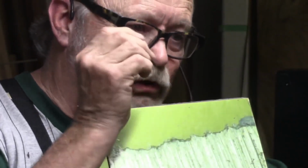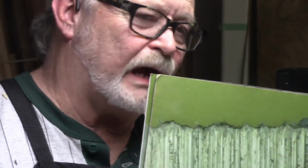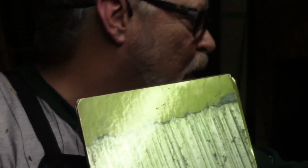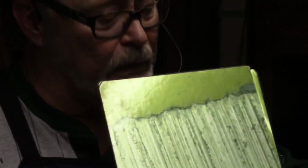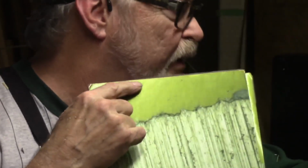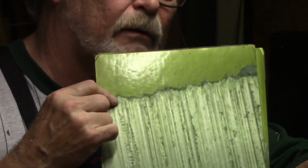And the grains are so perfect, and it's such refinement. And so they had heard stories too, and I've had professionals tell me that some of the tools like Jerry Glaser developed, you can't get them sharp. You can't get them as sharp. So they had me do a whole series of studies with gouges and skews, and then later with scrapers, believe it or not. And what they had me do was prepare an edge and cut the wood with those different prepared edges and in different steels. So this is a skew chisel, what it looks like off a grinder at 200x.